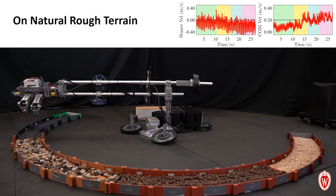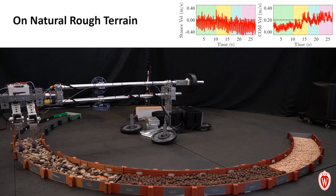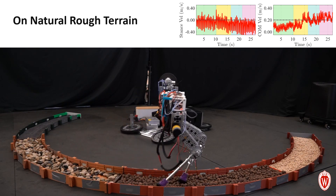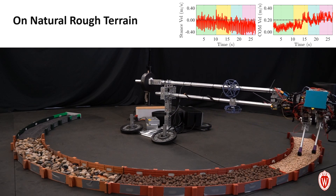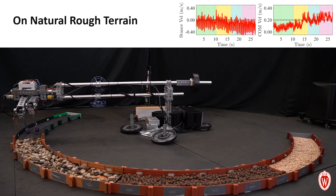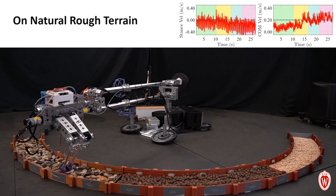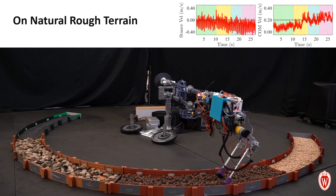The walking of STRIVE is extended on natural terrains here. One can thus use STRIVE to evaluate locomotion algorithms over rough terrains and test robustness of controllers. The terrain is set up with 3D printed LEGO-like trays that can be stacked together — this elegant design makes it very easy to set up different terrain types and lengths. The complete 360-degree setup costs less than 200 US dollars. Here, we demonstrate walking on four terrains, and the resulting system trajectories indicate that one can use STRIVE to study machine learning on terrain identification and classification.